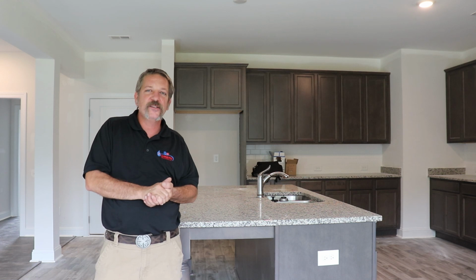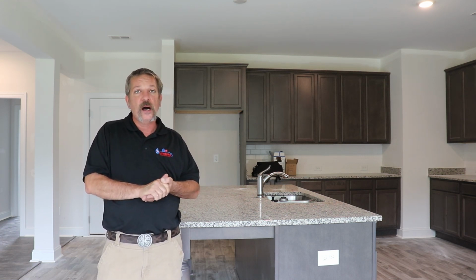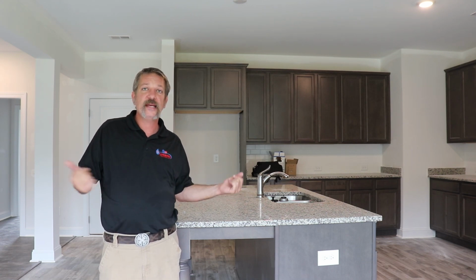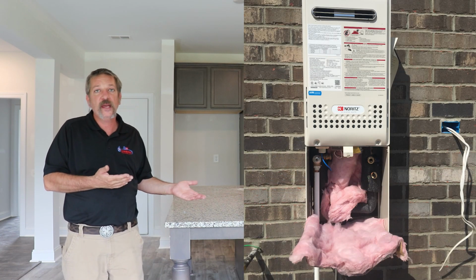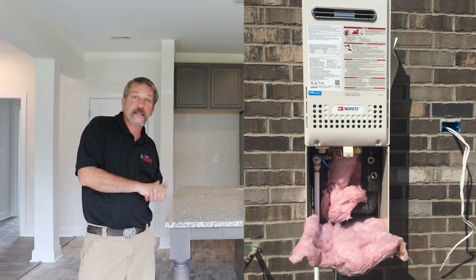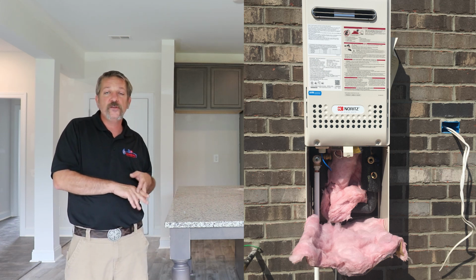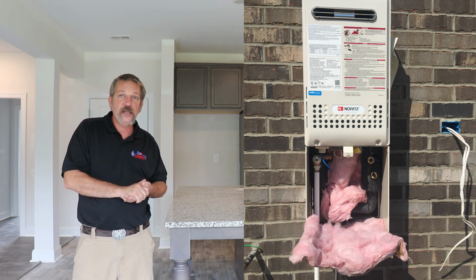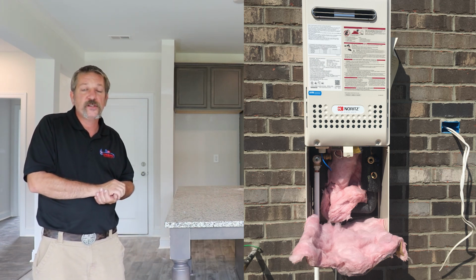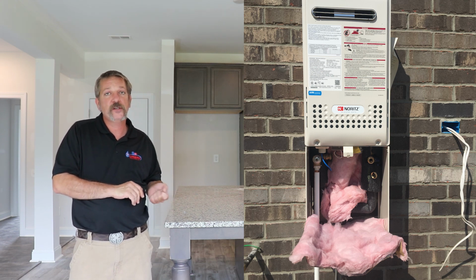Well, I wanted to go outside and show you some things, but it's pouring down rain, so I'm just gonna talk about it here. You're gonna wanna check your water heater. You're gonna wanna go ahead and take the cover off the bottom of that thing. Look inside, make sure it's properly insulated, make sure everything's hooked up, the remote's hooked up, that you've got your relief tube coming down within 6 inches of the ground. Rub your hands around, make sure you don't have any leaks.